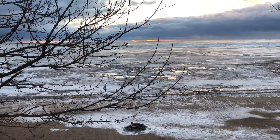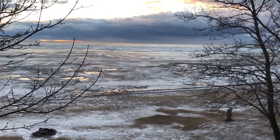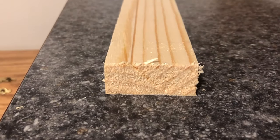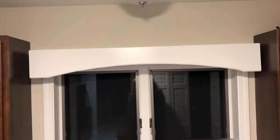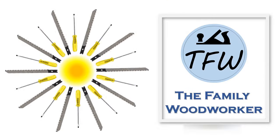We made the trip back up to the cabin — it's still pretty frozen outside — but it's time to actually hang these valances. We're going to do that with a French cleat system: two pieces of wood cut on a 45-degree angle that lock in place. One piece is mounted to the top of the valance, one to the wall, and it allows you to take it on and off for cleaning. Here's the finished 60-inch product, two 27-inch ones in the smaller bedroom — they look great — plus the 51-inch in the laundry area. One last parting shot: a sunset as we left for the weekend. Thanks for joining me, I hope you enjoyed the video — take care!